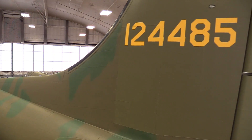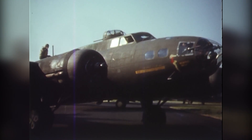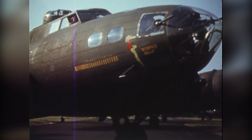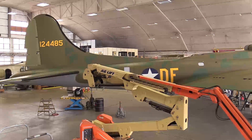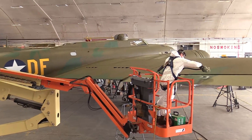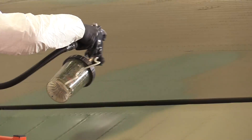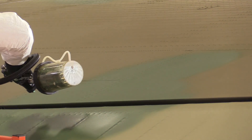The paint job is to a certain period in the war — after they completed their 25th mission, but before the war bond tour that they went on. So that's why when you look at the aircraft, you'll see several different colors of green. The painting process lasted a couple months; it was very extensive. We were looking at pictures down to the single rivets on the aircraft to try and get markings where they belong. A lot went into selecting the certain colors for the aircraft, getting different versions of those colors to get it just exactly the way it's supposed to be.